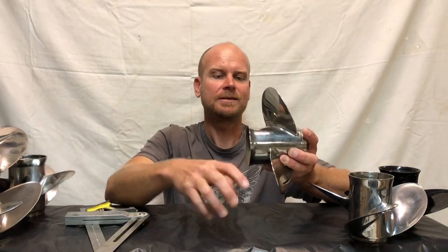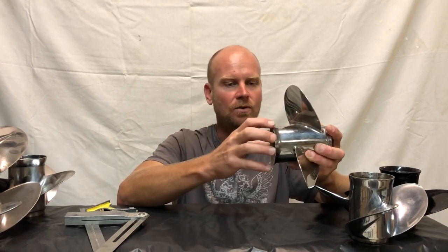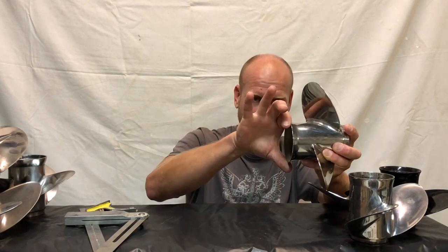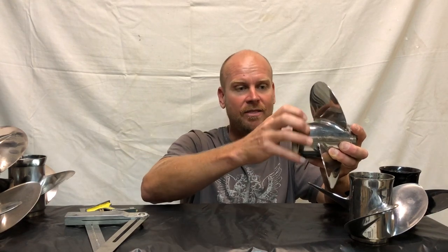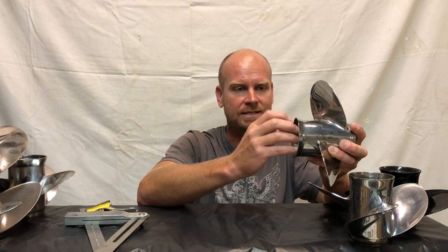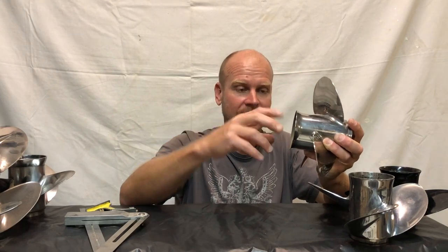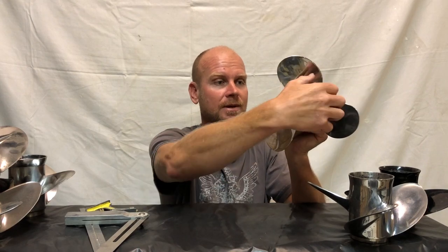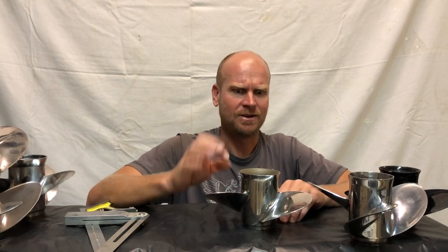Another simple thing is that little bell on the end there — a lot of people wonder what that's for. The exhaust gases that come out of here create a high-pressure tube for those exhaust gases to run through in the water. Without that, it is quite easy, especially at low speeds, for the exhaust gases to come in and contaminate the water in here and cause cavitation, especially whilst turning. As the motor turns, the exhaust gases will come around that side or this side.